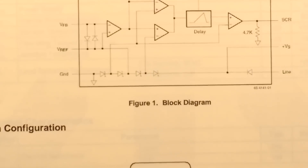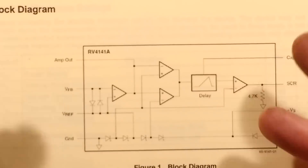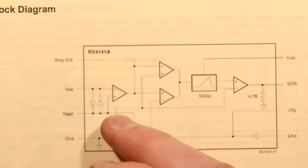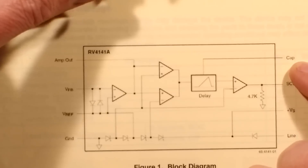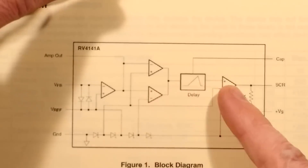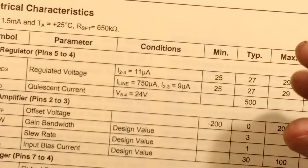If you look at the module inside, it has all the circuitry required. There's an incoming supply with a shunt regulator — all you need to provide power is basically put a resistor and feed the line to this unit. It operates at very low current and generates its own internal voltages. It's got sense inputs on op-amps to detect the sense coil. Once the correct conditions of a fault are detected, it triggers a delay timer — an external capacitor sets the delay, probably used for making it less sensitive, allowing ones downstream to clear first. But if the fault continues, it then triggers a thyristor output which fires a thyristor. And this is what really went bang, I think — but it was a symptom caused by the other fault.